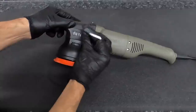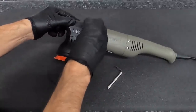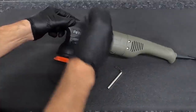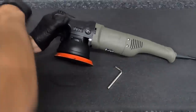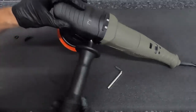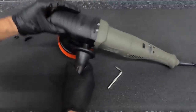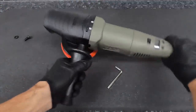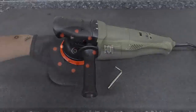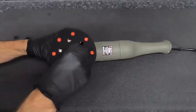Let's start to break this down and have a closer look. You can take out one of the hex side bolts and insert a polisher handle depending on what you're using it for — on boats or larger vehicles with huge panels like a box truck, this handle may come in handy. Otherwise, just keep it off. We'll take off the backing plate now and can see the counterbalance, then remove the shroud and break it down to the gearbox.